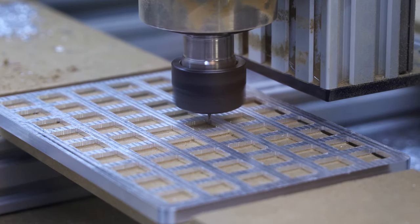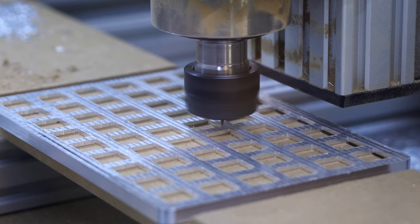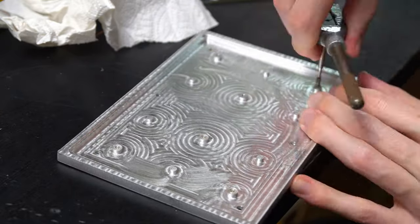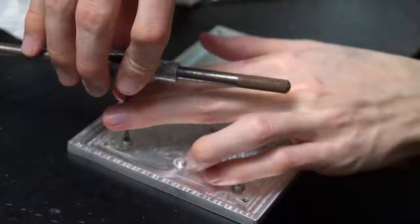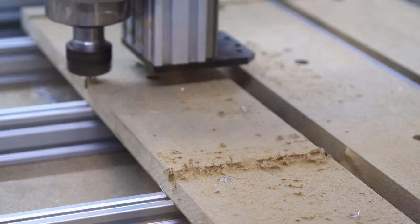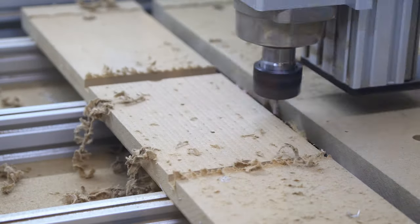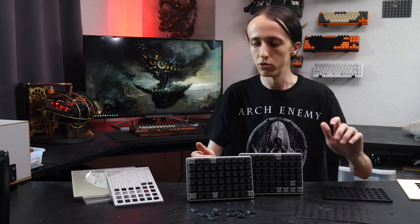The way I held it was to first use some double-sided tape and screws around the perimeter to clamp it down to my MDF base plate, machine all of the internal features including the little holes where I later screw them in, then tap those holes and machine a negative image of that inside pattern into the MDF board, and screw the plate down from underneath — which then allowed me to access the entire top part and machine that clean all around. It looks beautiful. If you want to see more about the machining, check out my recent review of the Ratrig Killer Bee.